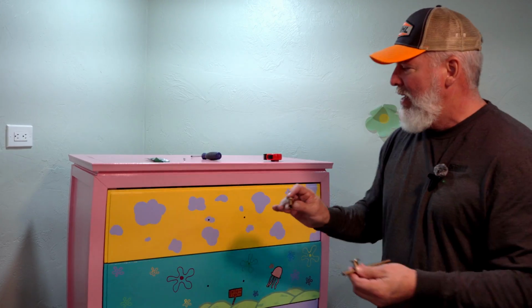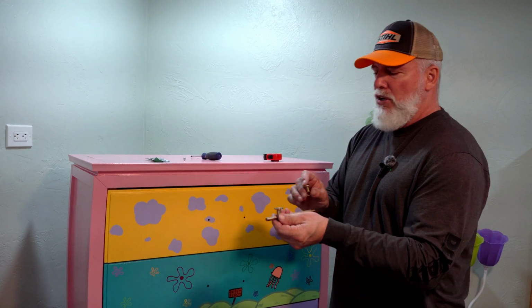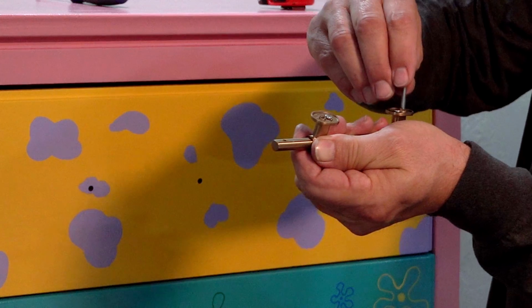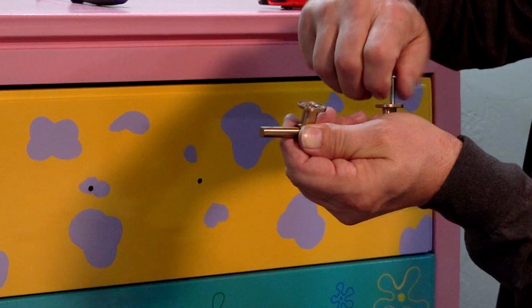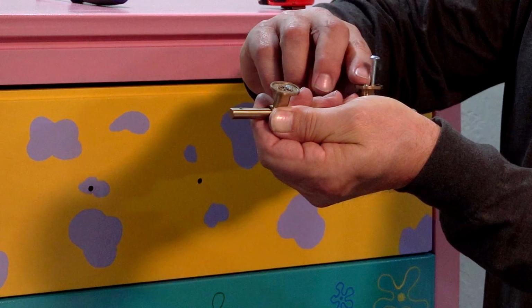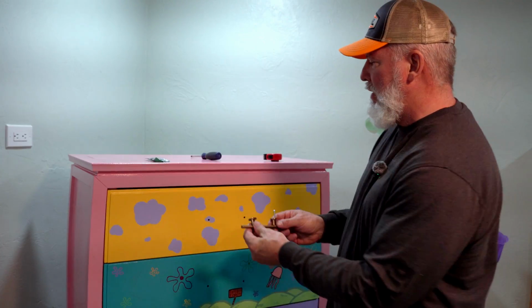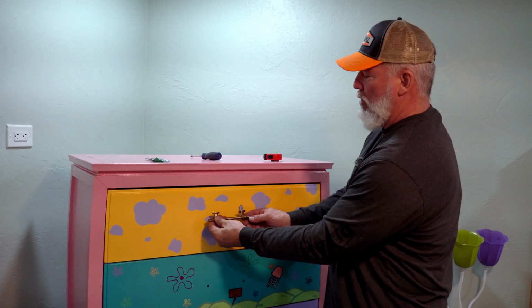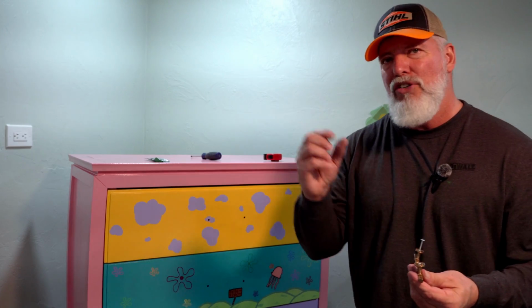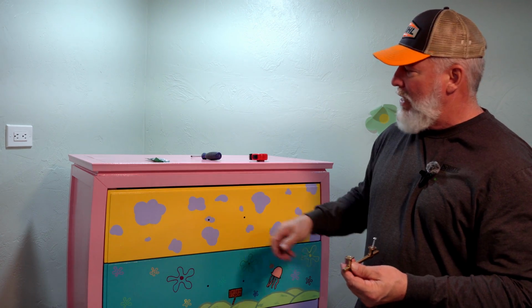And when you mount them, you leave it a little bit loose so that this bar can move. And when you crank down the screws, like these, that will go through the back of the drawer, you tighten those screws down, it's going to push down on that little pin, and now it's going to lock it into place. And the big thing you got to do there is you just want to make sure that your bar is even on each side. And in my case, it turns out to be 1/2 inch on each side. I'll use my little tape measure, measure it out.